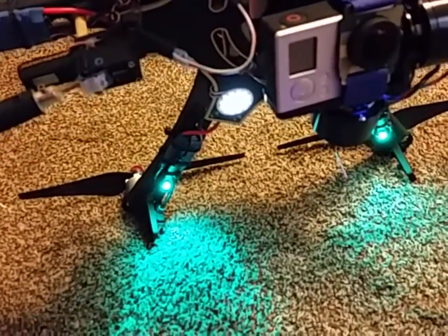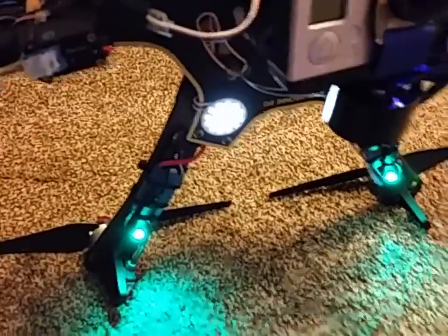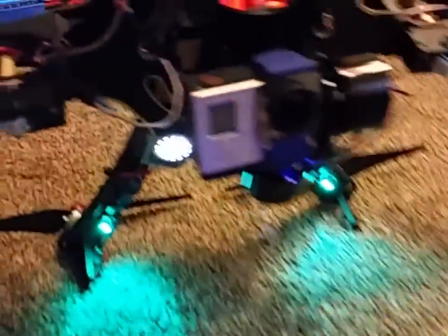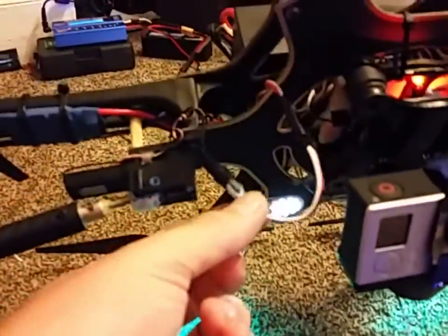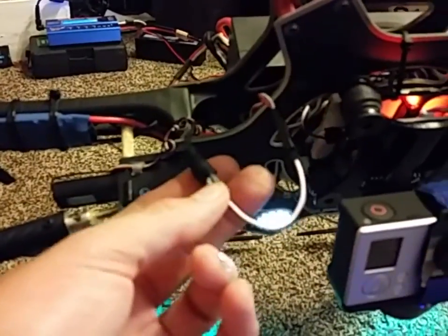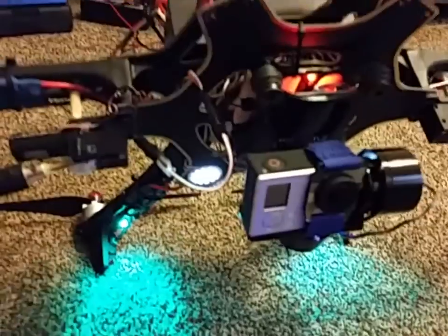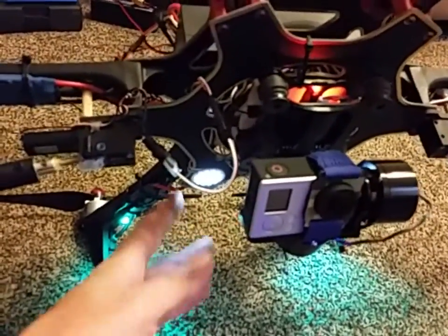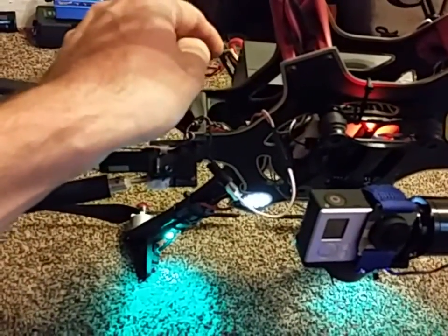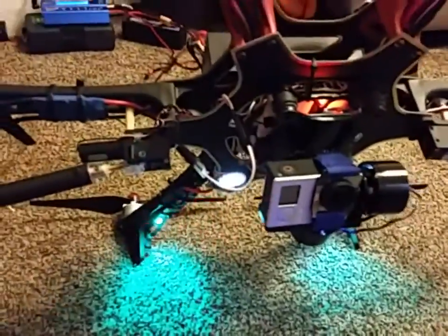Some people may have something to say about the dimly lit LED. I think with some LEDs that would not happen, and you have the option of powering straight through the switch. This switch provides a 5-volt source, but I wanted more — I didn't want a 5-volt LED, I wanted about a 12-volt LED. Hence the reason I used a resistor to pull some of the voltage down from this 4-cell LiPo, which otherwise made the light very hot.